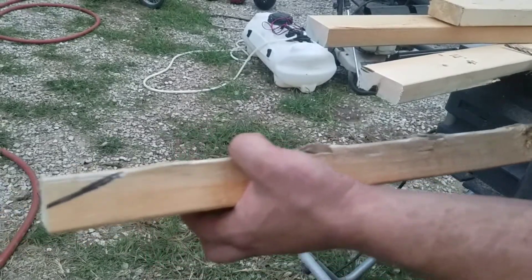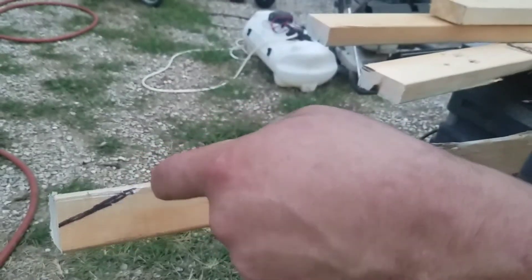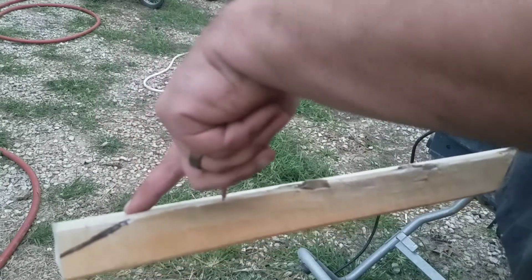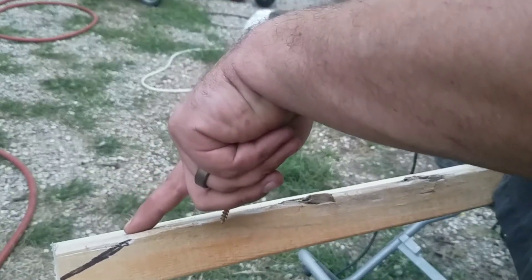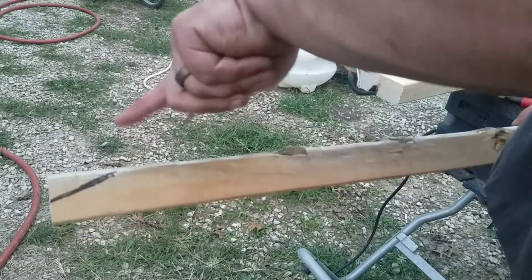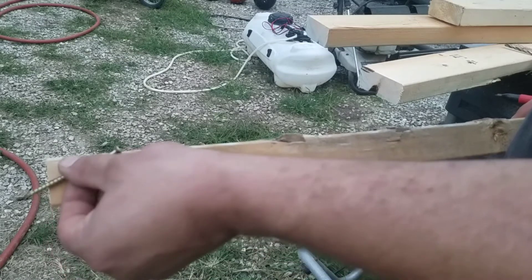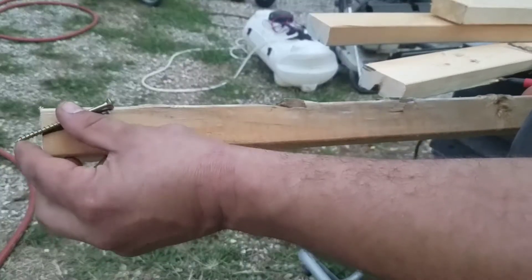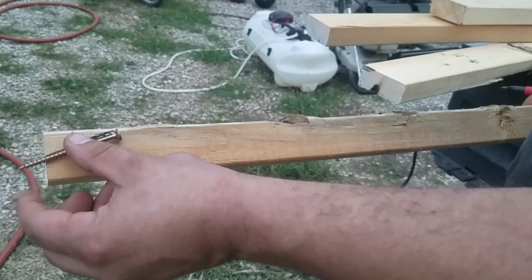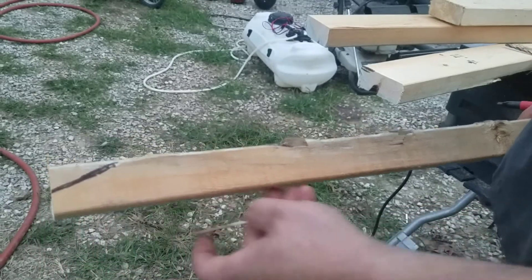You've got a pretty steep drill angle, so I always start out more perpendicular and then turn it so I'm actually drilling into the wall of a small hole that I drilled down and over. I try to measure about where I think that screw is going to pull down to and make sure the screw tip won't come through the bottom of the surface or protrude through the back side of the next piece.